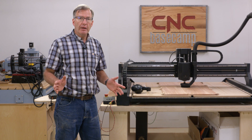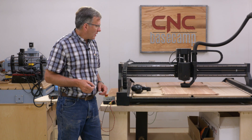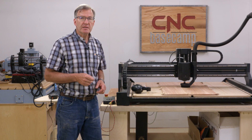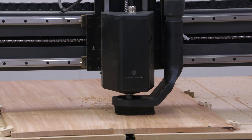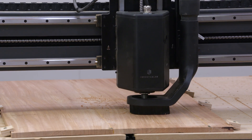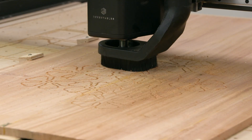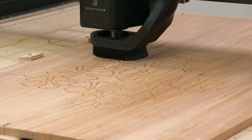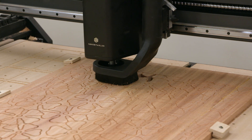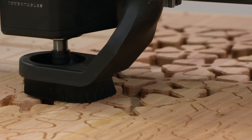It's time to go ahead and cut out the main panel. As you can see, I've got it in place on our Inventables machine. There are going to be two steps to this. The first is that I have a 60-degree bit in place and it's going to cut the outline of everything, so you'll see all the flower patterns start to form. After that is done, I'll swap to a straight quarter-inch bit, which will actually pierce the panel and give us that very light, airy look I'm after.